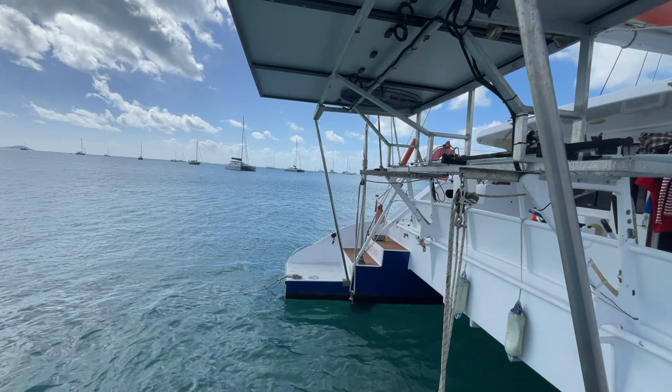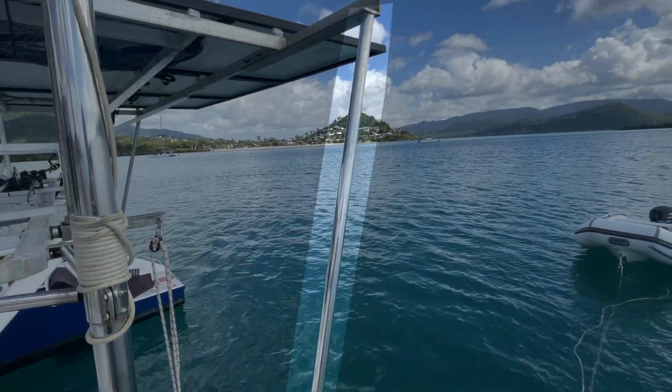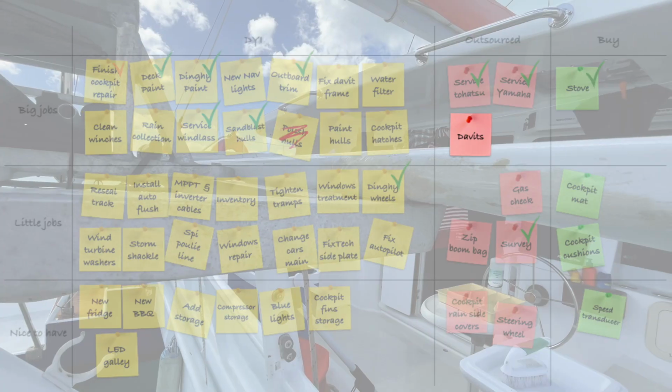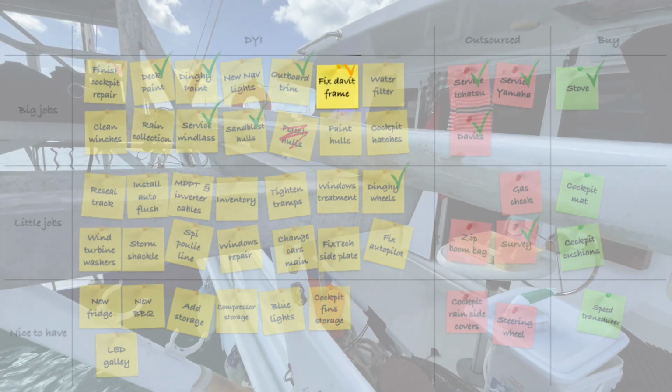For the davits at the back of the boat, we got help. 2 stainless steel support bars were added from the sugar scoop to the extremity of the solar panel frame, and we extended the arm lifting the dinghy. Meanwhile, we removed the rot in the wood and filled it with resin, which will still need to be painted and drilled with a new bolt.